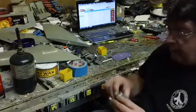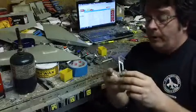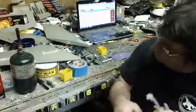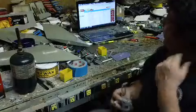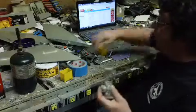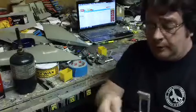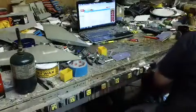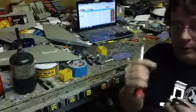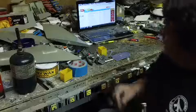By the time we get this clamped down, it ain't gonna move. So I actually even got that gap a little bit thicker, because that was just a blade width on my bandsaw. And it would tighten it up, but if you sat there and tweaked on it, it would turn. So what I did is, I did it on mine and I did it on Ollie's. I think mine was the one I discovered it on. But I took a bigger clamp. I want to see where it's sitting. Before I put the screws in it, I clamped it almost shut. Then took my hacksaw, a little handheld hacksaw, and just cut an extra width of that blade out of there, and then it's plenty. And it tightens up really tight.